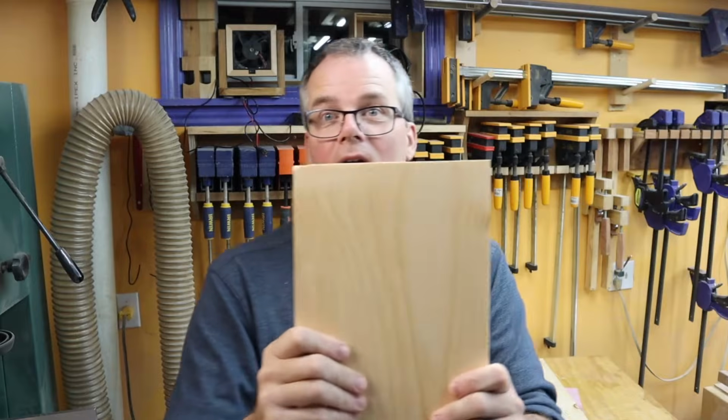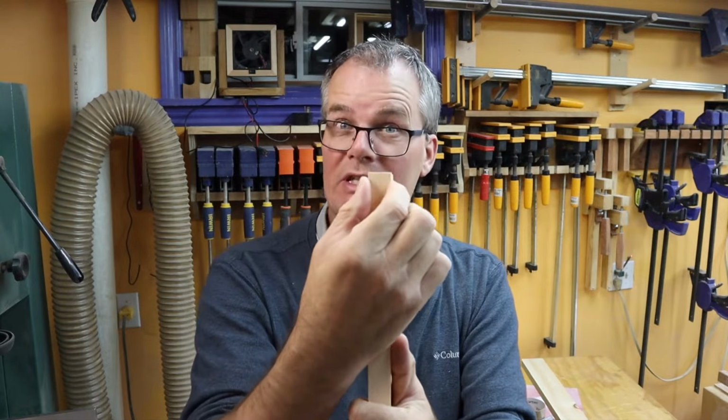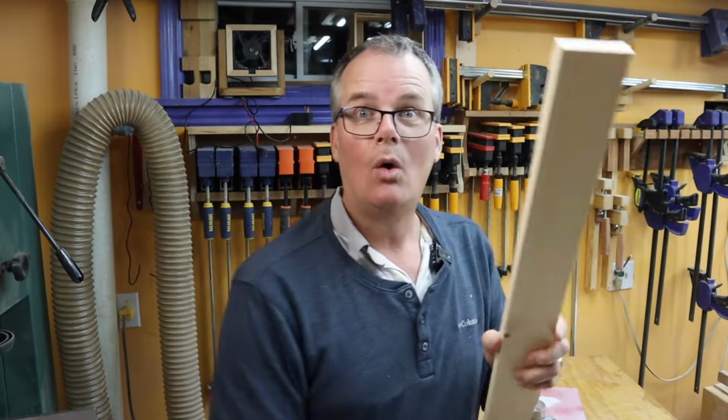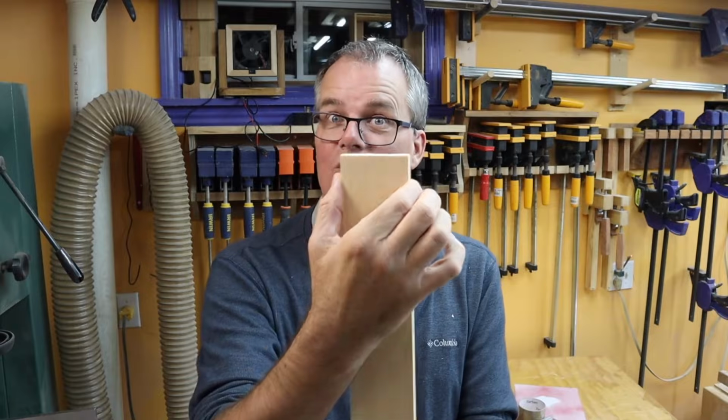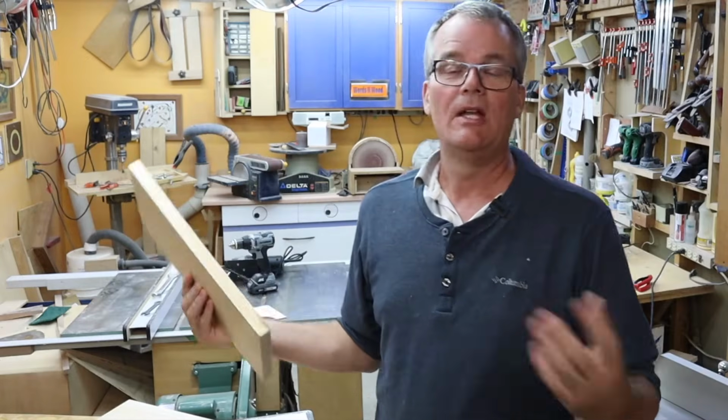And for any complete beginners at woodworking out there, just so you don't get confused, when you go to the building store, a 1x8, in reality, is 3/4 of an inch thick, 7 1/4 inches wide. A 1x3 is 2.5 inches wide, also 3/4 of an inch thick. That's just the way it is. Let's move on. Now I mentioned minimal tools.